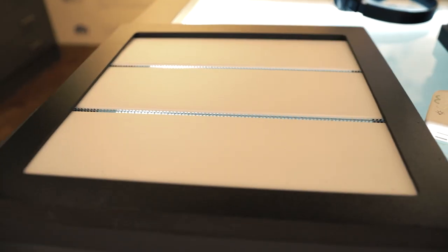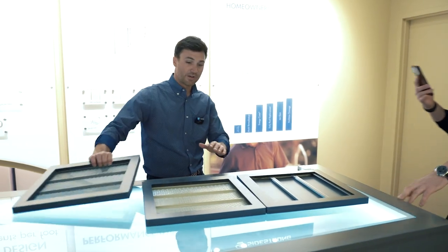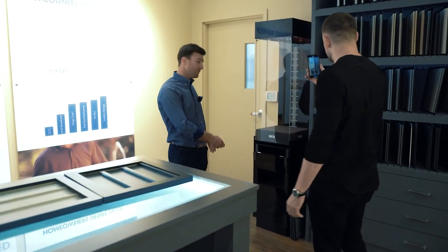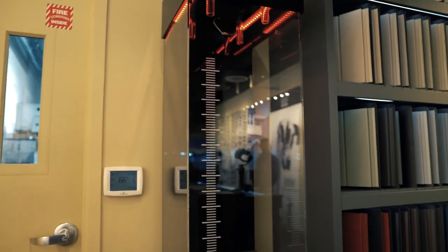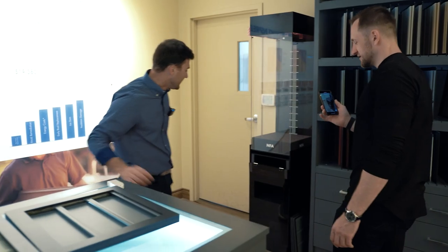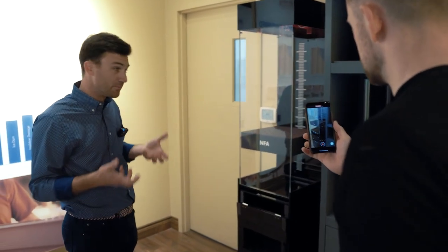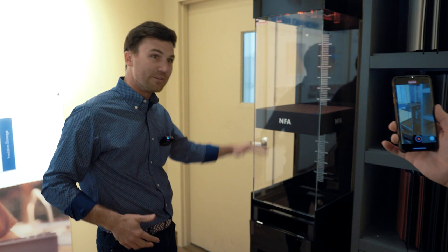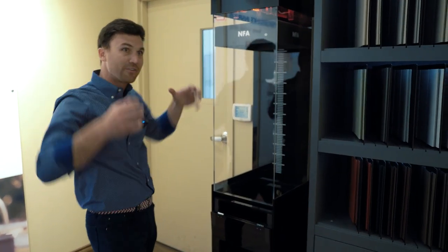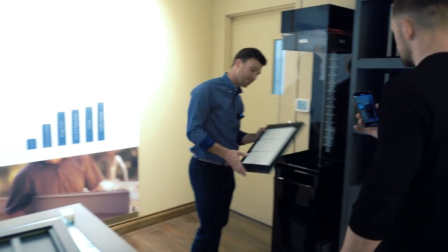Really cool, clean looks, because you're thinking about soffit. Let's see how all three perform. We'll plug them all in. I'm going to show you a couple things. We'll turn a fan on so you can see that I'm not blowing smoke here. Let it warm up for a sec. We like to talk about NFA — net free air — which is what allows your house to breathe. You can see what happens when you get good airflow: air is coming in and it creates an exhaust at the top if you're using a good ridge vent. I'm going to put the dented soffit in — this is not our soffit.